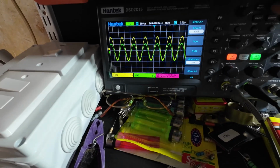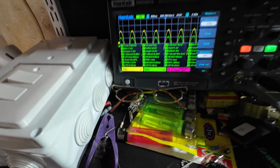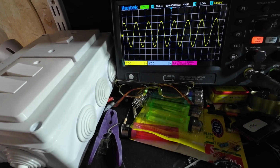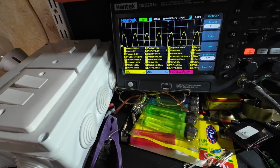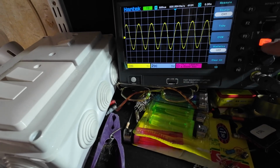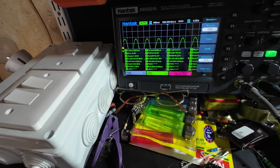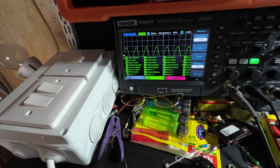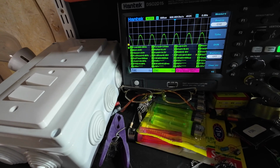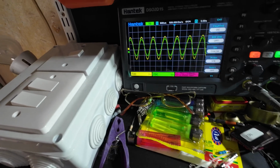And if we click on there, we've got 14.8 on that side. We had 4 before. And if we go off channel 2 onto channel 1, we've got 20 volts peaking. Go on to the other side, we're just about 14.6, about 5.5 volts, something like that, out. So that's pretty close. It's not brilliant, but it's pretty close. So that's doing that because it triggers on channel 1.